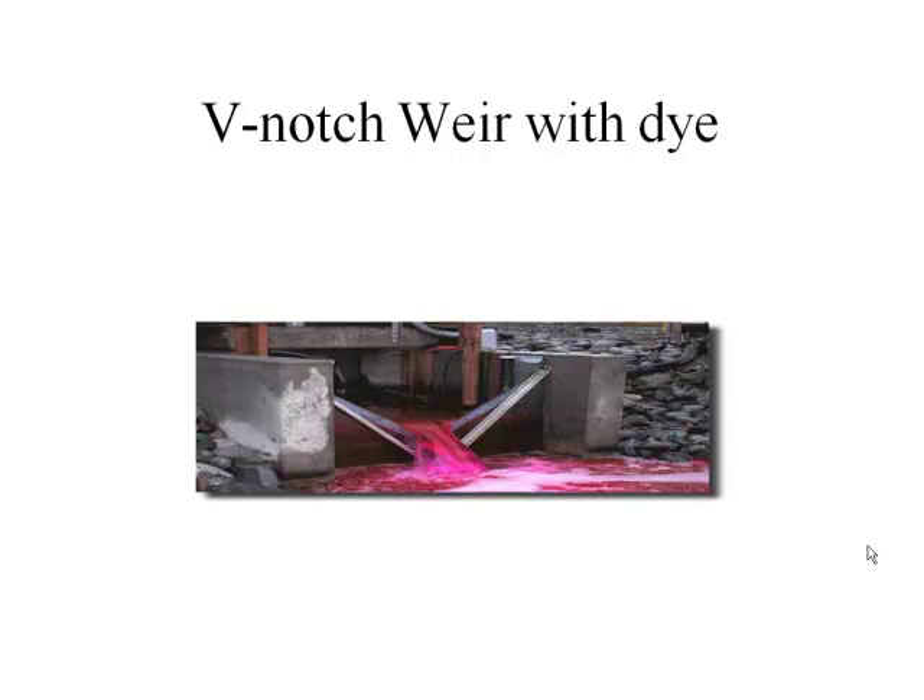This test is also conducted in industry. When I was an abatement officer, the city of Scarborough would go to industries and pour dye down their sinks and discharge areas to see if anything came out of the storm sewer. A lot of them were old buildings — old for Scarborough would be about 80 to 100 years old — and they weren't connected properly to the sanitary sewer, so stuff was coming out at the storm. Whenever I went to a spill, I'd always be there with someone from the city of Scarborough, and he'd look at the colour of the stuff coming out and know exactly which company had had the spill. We'd go there and sure enough, they would be the ones with the problem.